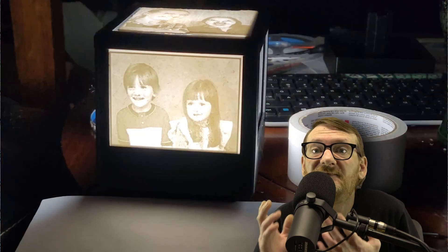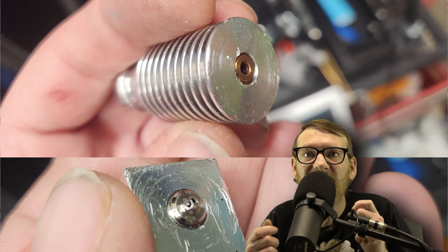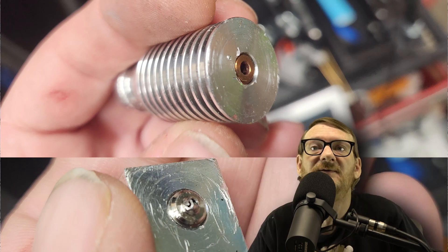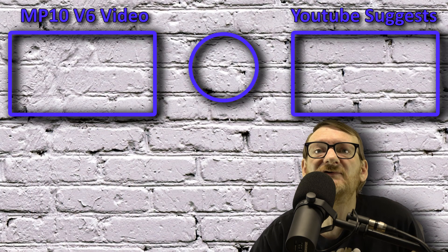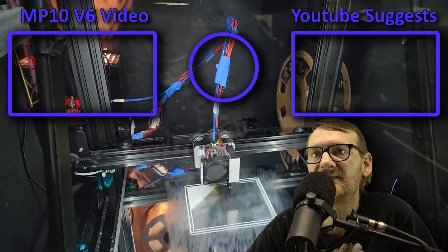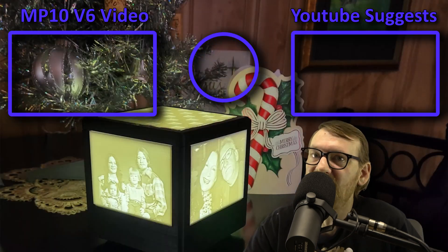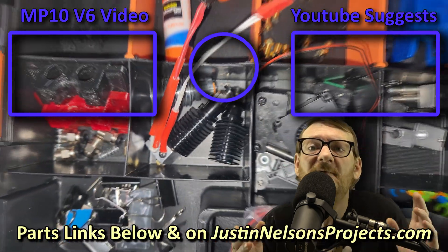This will prevent issues like what I had just before Christmas where a broken-off nozzle really put the pressure on as I was printing lithophane cubes as gifts. I was unable to remove the bimetal heat break from either end — the two metals actually came apart from each other. That's why I don't recommend bimetal for any reason; the two metals are just held together by friction. Luckily I had kept my original hot end in one piece so Christmas was saved, but I learned my lesson — get spare parts, they're cheap, keep them on hand always.